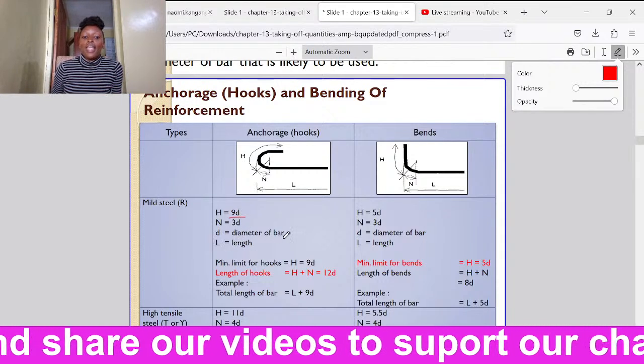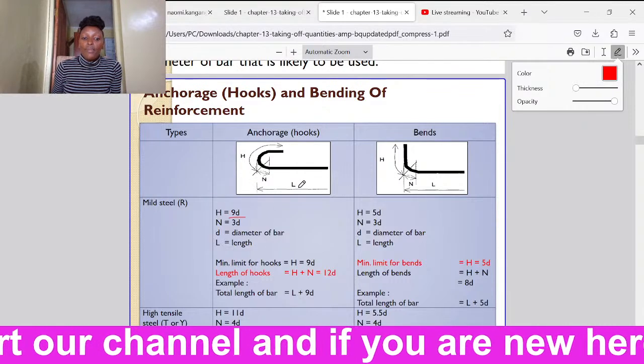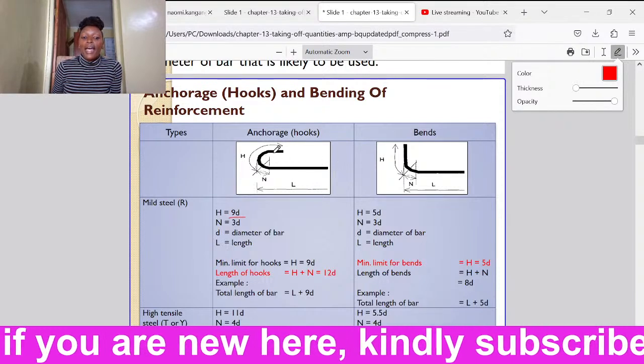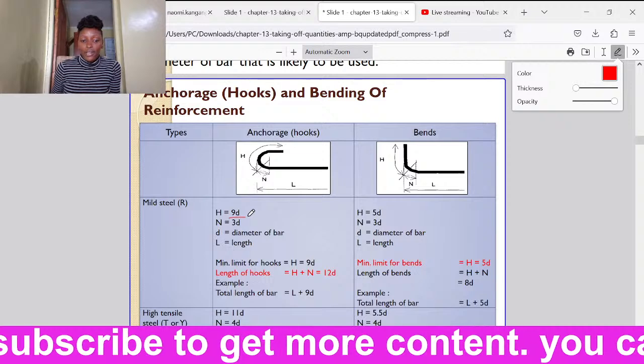So that D is the diameter of the bar, then L is the length. So the length here is denoted by L. If we want to know the size that we shall add after the size L to add to the hook, we will take 9D. All right.